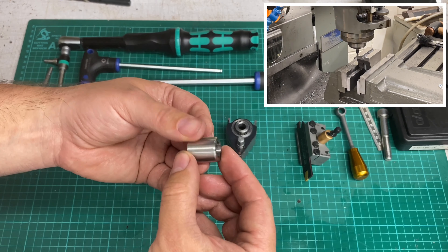I machined the slot in here to match the gauge block so that the gauge block would fit really nicely into there, and it did. Then I machined the width of this tenon here so that it would be a really good fit into there - there's no slop in there. For what I needed on here, it's a perfect fit. And what this does is prevents any rotation of the tool post mount. This protects it against any rotation in the X-Z plane and also any movement along the X-axis.